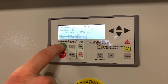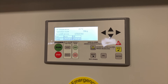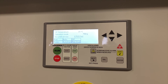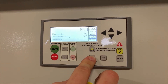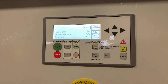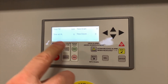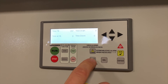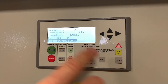To start the desorber press run. Right away the suction pump will start, the blower will start, and the heater will start once there's enough oil in the chamber. The system is totally automatic so from here you don't need to do anything. There are some info pages built in that you can use to monitor. One shows your hours counter and you can also change the units if you prefer psi or fahrenheit — the default is bar and celsius. The next page shows the time settings of the various parameters, which can help with troubleshooting. And finally there's a page monitoring the various temperatures in the circuit. Pressing again will take you back to the main dashboard.